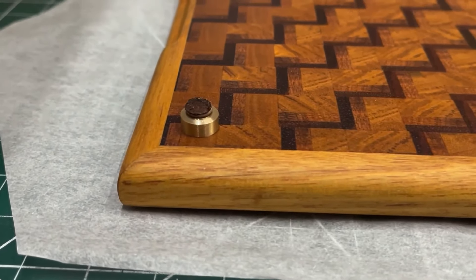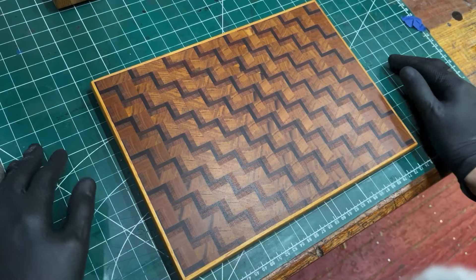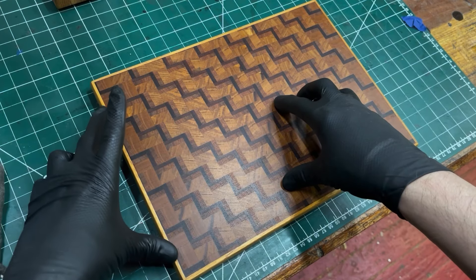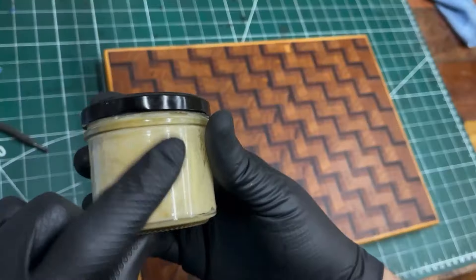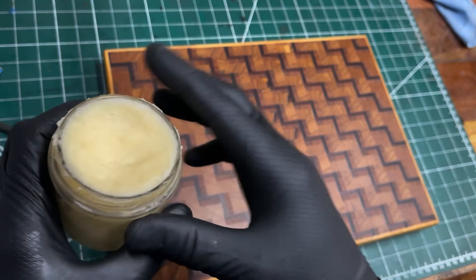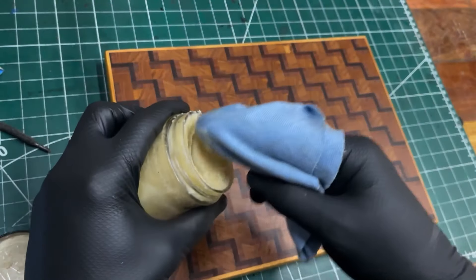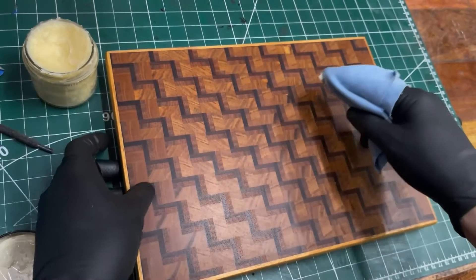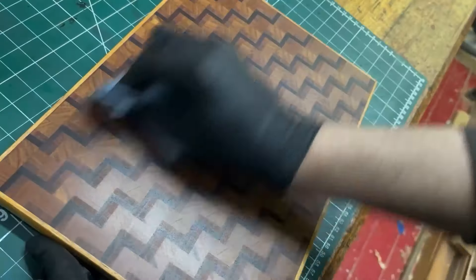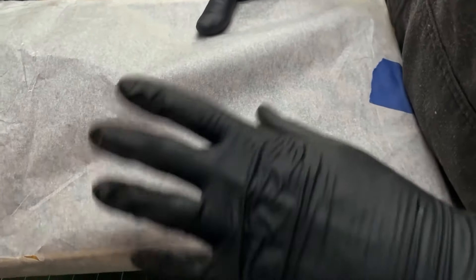I changed the feet to wee brass feet. So we're basically done. I thinned the trim out by putting a thin piece on — that should get this piece to move as the grain moves naturally. I made this up: 10% beeswax, 90% mineral oil, and it works amazingly — it's a super durable finish having the beeswax in it. We just want to rub it on and then buff it with a clean cloth. Get it in its wee sleeve and set it away to acclimatise.